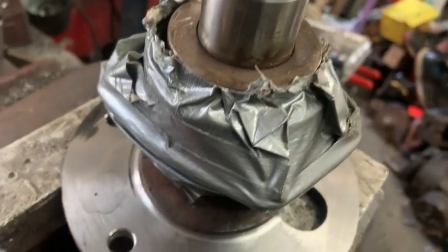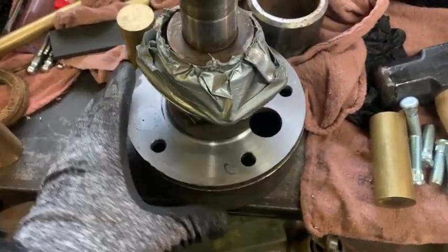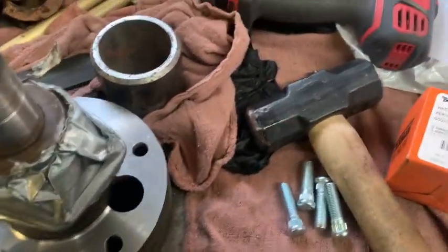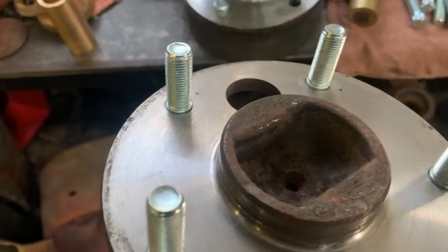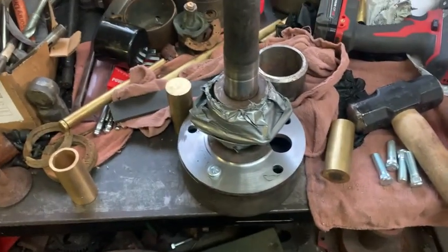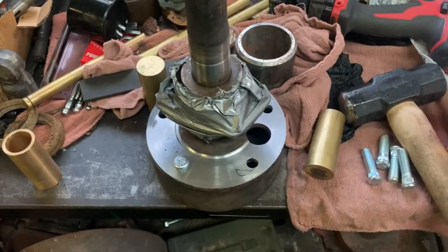Just the last steps: use a cordless hand drill to chamfer all the backsides so nothing sticks up below the surface. There are umpteen ways to put the studs in. I always use a tube face so nothing gets damaged — put your stud in, use a piece of brass, and about three hits with a good three-pound club hammer knocks them in. And it looks like this — this one's all done, ready to go. The only thing I'd probably ask first is we ran into problems before with modifying rims, where you sometimes have to turn that center register diameter down slightly. If need be, they just come back and that's not a big deal to turn down.